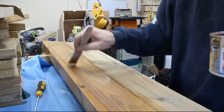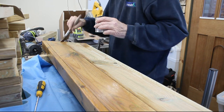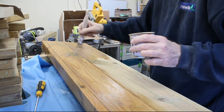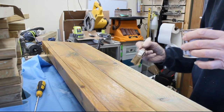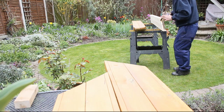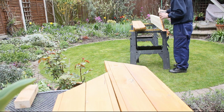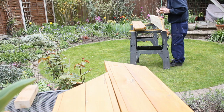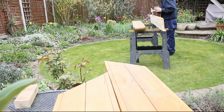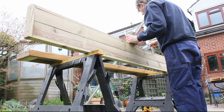And then I took them back to the shed and started to paint them back in the small shed with a coat of the oak stain that I'd got left over from the benches that we'd done for Chandler Court, the old people's home. And this is a Cuprinol, I think, stain that I use, that it goes off in about 10 minutes, so it's very easy to use, just a light oak finish. I had to do some of the larger ones outside. Fortunately the weather was good at the time, so it enabled me to get them done on an afternoon outside, and as I say, it dries that quickly that you don't get any problem with bugs or anything getting into it.